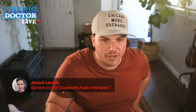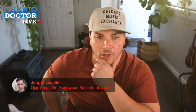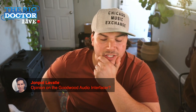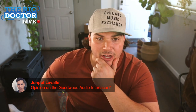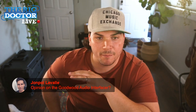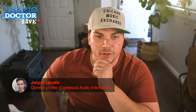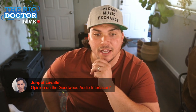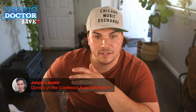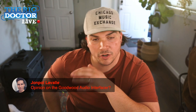I'll answer this one: opinion on the Goodwood audio interface. We talked about this a little bit earlier, Jean-Paul. There are no specs published on their site. All we know is that it takes 100 milliamps. As I said before, if you are designing a buffer and the purpose is that it's neutral, not publishing those specifications means either you don't know the specifications you need to hit, which is problem one, or you're not meeting them, so you're not publishing them.